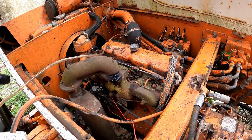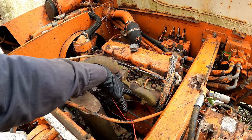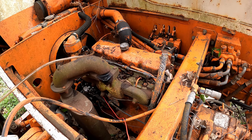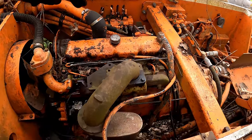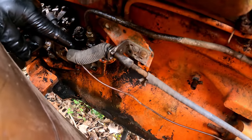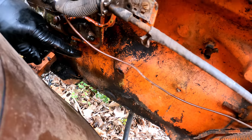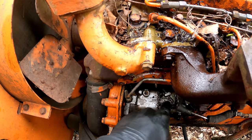There's a ton of flow out of the return. Last thing I want to try: I hooked the return back over to the diesel fuel can, cracked an injector loose, and I want to try bleeding — because if there's air in the high-pressure fuel system, it just will never compress. Yeah, I got nothing coming out of this one that's been cracked loose. I'm going with injection pump. I think somebody may have ran this dry or with really crummy fuel, or maybe it's just from sitting — but it's not passing fuel through. We bled it at the filter, had good diesel. I bled it where the line comes into the pump. The solenoid clicks when it goes, so that could be hung up. I cracked the lines down where they come out toward the cylinder head — no flow, and definitely no flow up at the injectors. The pump just doesn't seem to be passing diesel through it.